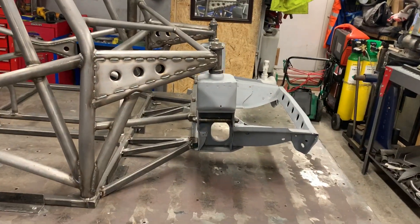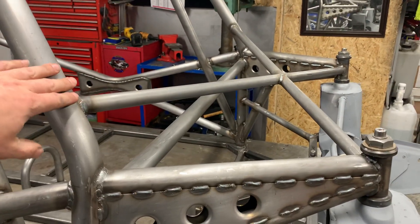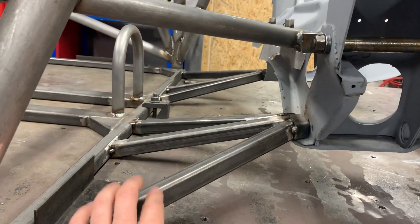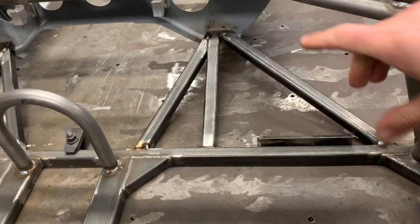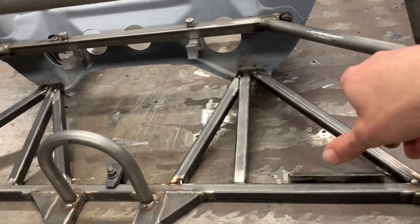It's not having this front subframe on it — it's actually having a Honda front subframe on it. So what I've had to do is set these at a slightly different angle; they're slightly higher. These are set but they are just tacked in because I don't know what the rear of the subframe is like on the Hondas.